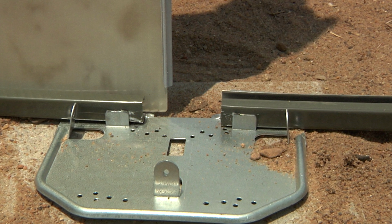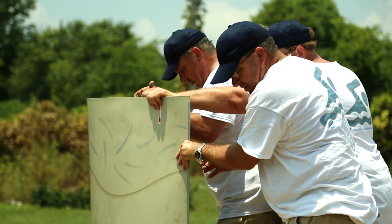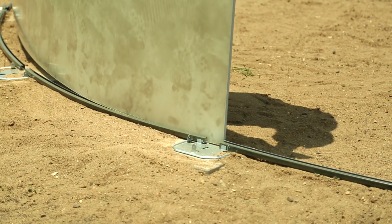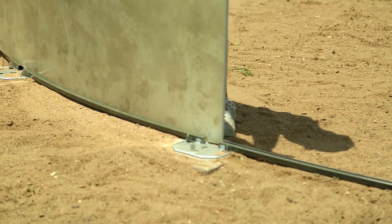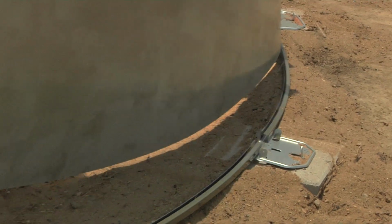Always start at the center of the vertical end cap so the vertical will hide the wall joint. Uncoil about 6 to 10 feet of the wall at a time and insert the bottom edge of the wall into the groove of the bottom rails as you go forward. Placing the coil on overlapping pieces of plywood will make it easier to unwind the wall.